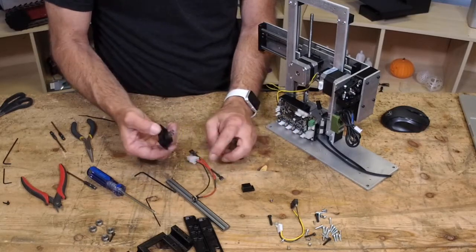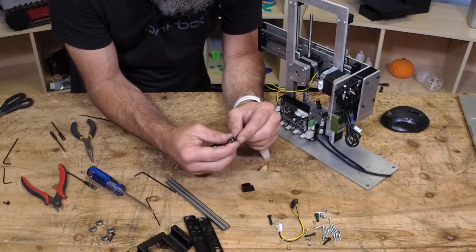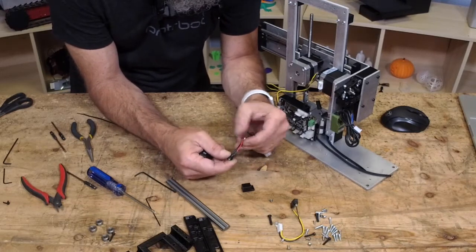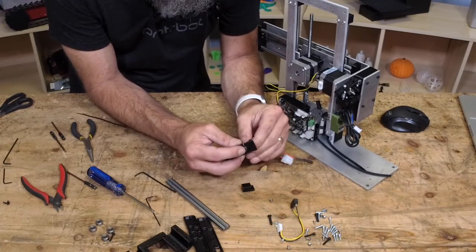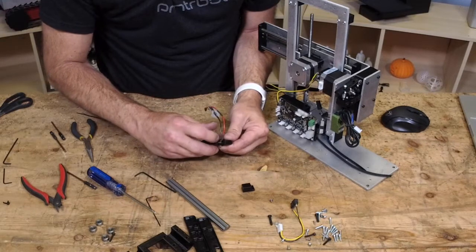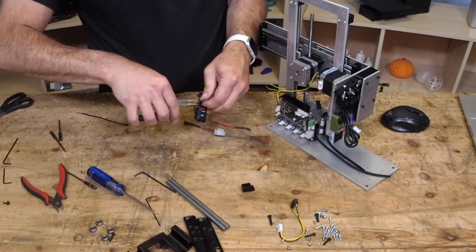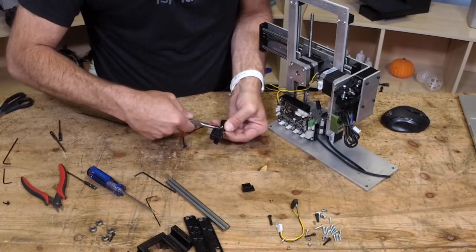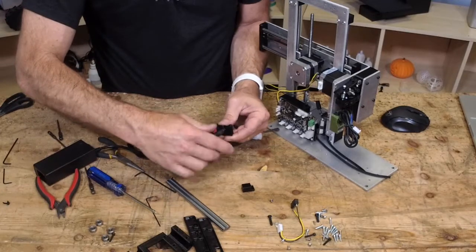Because you need to put it through that hole, we left these blade connectors. They're freaking strong. It's ridiculous, in fact. When you try to get those blade connectors off, you'll see what I'm talking about. But I take this little nut back, and then this can feed through, and so that barrel connector, now that little nut will be able to hold it in there. So you can get some needle nose or something and hold that nut and see if you can get that tight. It's a little challenging, actually. But with a set of needle nose. So that's your power. That's what's going to hook into the power, right?